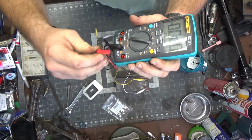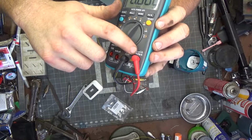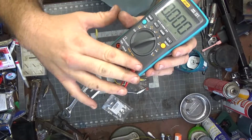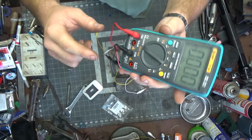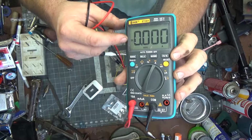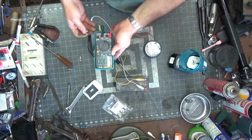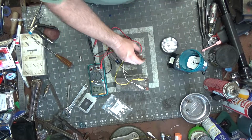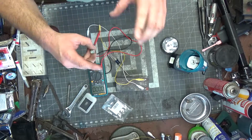Typically, when you're doing just about anything, you have the multimeter set up like that. Your diode, capacitance, temperature, ohms, resistance, hertz, all that other stuff is going to be off this one. But when you want to use this like an amp meter, up to 10 amps, you're going to need to move it over to here. And then I'm going to run this in line in the circuit. And then it's going to give me the amperage. You can see it's a DC. That DC amperage that's running through the bulb. And I'm going to compare the two. And that'll give us some sort of a baseline as to how much more efficient this LED is than the regular incandescent. Hopefully this shows up on the camera, but I'll also insert the numbers on the screen when I figure it out.